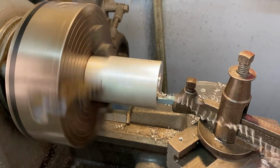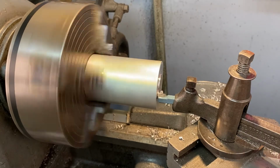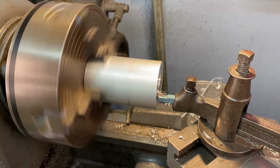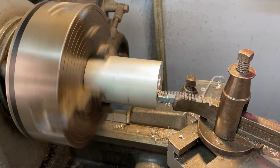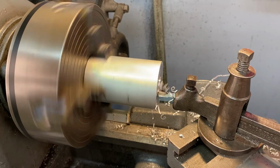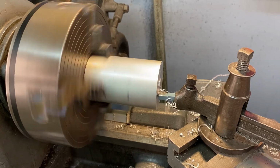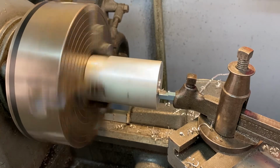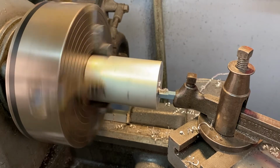And if we didn't have that hole drilled, like maybe we're trying to face this so that we have a really smooth surface with absolutely no hole there, you might get a little button on there. If you get a little button on there, it looks like a little nipple, then that's going to be a little below center. That's okay. You can always file that off. So that just means you got to raise your tooling a little bit. So when you're done with this, if you have no hole on the center of your stock, it should just go perfectly smooth. So you have maybe a tiny, tiny little needle there, which will break off.